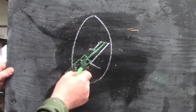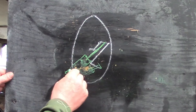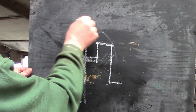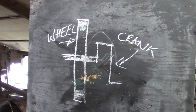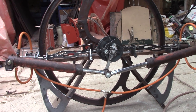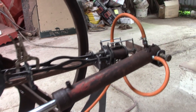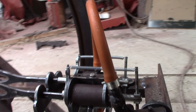In theory I could have arranged them differently and still had them working 180 degrees out of sync, but I would need a crankshaft that doubles back on itself, which looked tricky to make and would probably need another bearing. So instead I took the old engine apart and set up both pistons horizontally. It takes up more space, but that's the only downside, and I can use the same cams for both sets of valves.